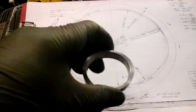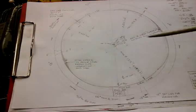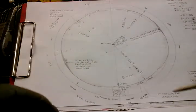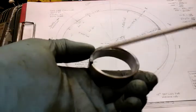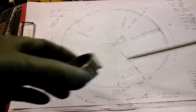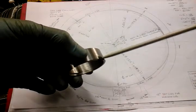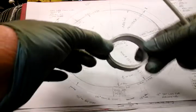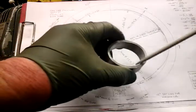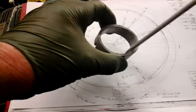What I've done is made a fixture in my Myford lathe — that's where we are at the moment. I've made a fixture so I could calculate all these angles where the lobes fit in relationship to these slots. This slot here is the peg in the magneto, and the width of this slot works in coordination with this groove inside to get your advance and retard. These lobes on this cam have got to be made precisely to the degree and to the thousandth of an inch.